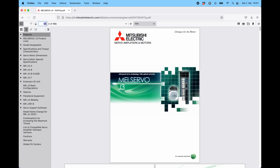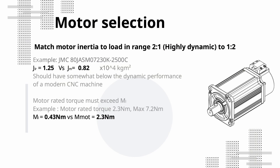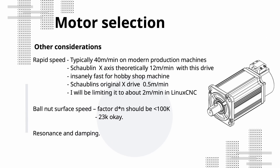So we can now dive into a catalogue to select a motor based on its moment of inertia and rated torque. Or in my case, since I already bought the motors, let's see if they were a good choice. The rule of thumb we were taught: a motor inertia double the reflected moment of inertia of the load will result in a highly dynamic machine; a more typical machine should still have a motor inertia of between half of or equal to the reflected load. The motor I have for the x-axis falls in that range. It also easily exceeds the torque required at rated power — in fact it's a significant overkill, and a more compact, cheaper motor could probably have been chosen. You also need to check if the selected motor can drive your axis at the target rapid rate, and again I'm well into overkill there.